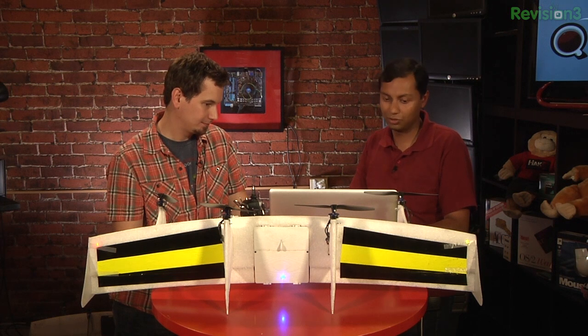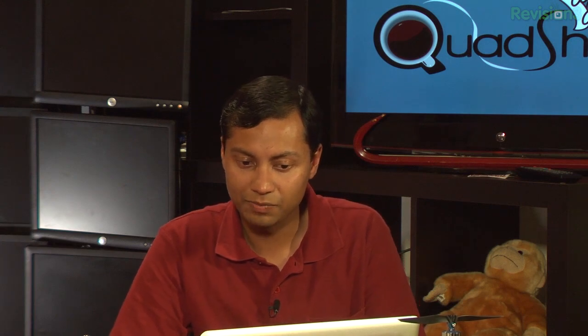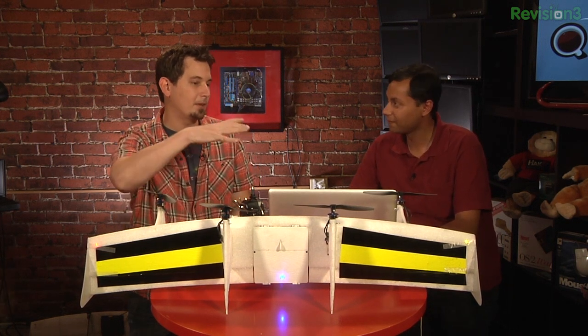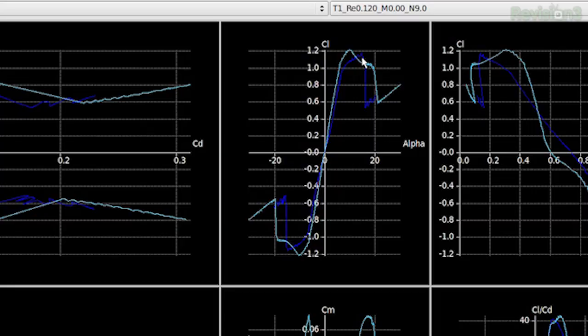It's a VTOL aircraft and it goes through some really high angles of attack. Our real design criterion for the airfoils was to make sure that the stall region was pushed as far out in terms of alpha — the angle of attack — as possible. You can see the dark loop is a standard NACA airfoil. NACA is the National Advisory Committee for Aeronautics, which was the precursor to NASA. This is a baseline symmetric airfoil. We chose symmetric airfoils because we wanted this aircraft to fly the same way whether upside down or right side up. The standard NACA really stalls fairly sharply at just over 12 degrees, while our RF airfoil in light blue stays above a CL of 1 all the way from 5 degrees to 20 degrees of alpha.